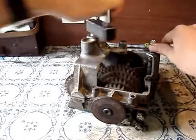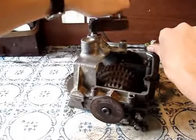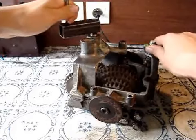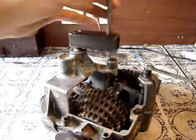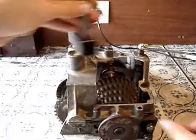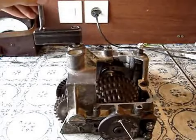Now going to reverse. The reverse gear has exactly the same things as the forward gears — it's got holes cut out of it for a little tab on the other end of the gear selector to slot into. So neutral, then into reverse — as you can see it's spinning in the opposite direction to these five forward gears.